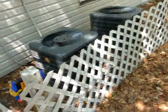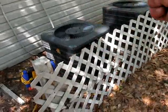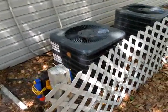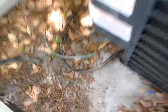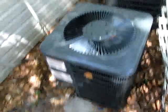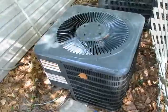Alright, here's our next two winners — two Goodmans again. You can see from the square frame; this one's the newer one. That one's the 2009 model, this one's like a 2010 or 2011. We're going to repair a kink in the copper here — when it comes around there, it's kinked off. We're going to take it out and re-pipe it. The other one we just need to level up and put on a pad because it's horribly unleveled. So we're going to start with that — on with the show.